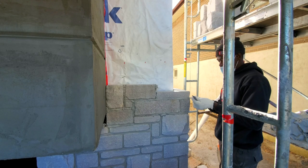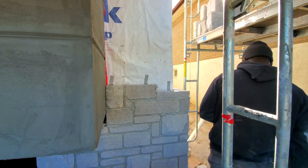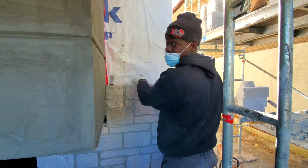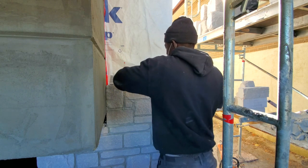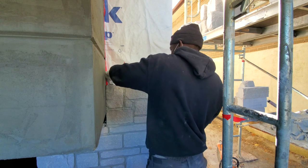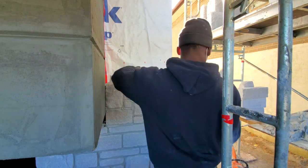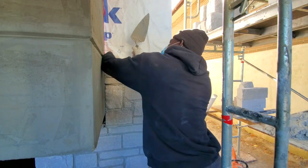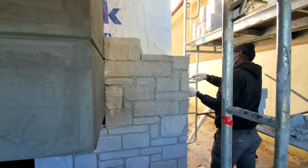We're going to put some brick ties now. As you go up, you want to install brick ties — this is what we use to maintain the strength. I knock it to hear the sound from the inside so we can put it right into our studs. It's better to put it in the last hole at the bottom of the brick tie as well. If you have any questions concerning the stone installation, feel free to ask them down in the comments — I try my best to answer all your questions.